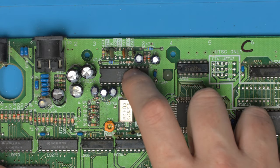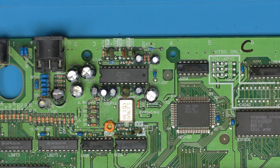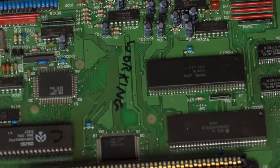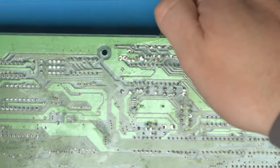We know for a fact this CXA chip is fine because on the first revision board, this is super clean, perfect RGB. So there isn't an issue with this chip. This chip isn't noisy. There's an issue with the circuit board design. So if we look at, obviously, the crystal, let's just flip over, try to get our bearings. The traces might well be under these chips, but let's just start with what we can see on the surface.